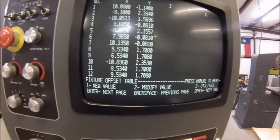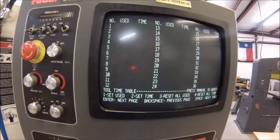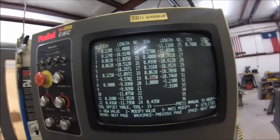If you want to track the tools you're using and how long they were used, you have to engage that in the program — but this is where that data would show up. The next table contains internal machine parameters used for calibration of the machine. Unless you have a serviceman on site or on the phone, you're never going to mess with those V values. Don't just start poking stuff in there out of curiosity — something bad will happen. If a service tech tells you what to enter, then do it. Otherwise, leave them alone.